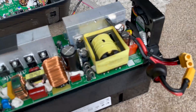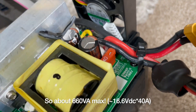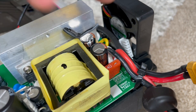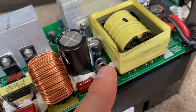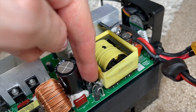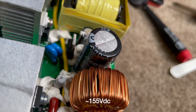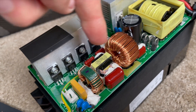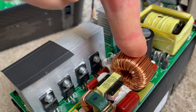On the AC side, you've got the inverter. On the DC input side, battery voltage comes in through a 40-amp fuse — that's the fuse I believe opened. It's soldered through, but you can remove the board, desolder it, and populate it with a new 40-amp fuse. There's some bulk capacitance, then a big step-up transformer going from about 16 volts to 110. On the other side there's a rectifier array — you're stepping up and then rectifying to get a stable high-voltage DC supply. A 250-volt capacitor smooths it, then it runs through the pure sine wave inverter stage, which has a one-to-one transformer — likely an isolation transformer — and a common mode choke.